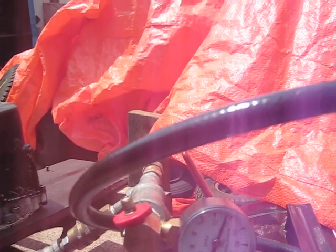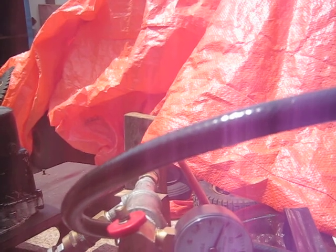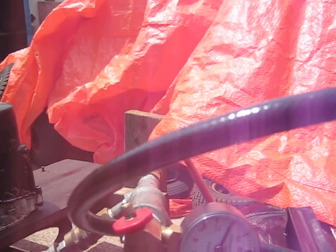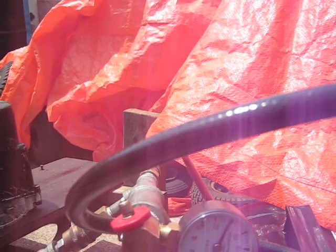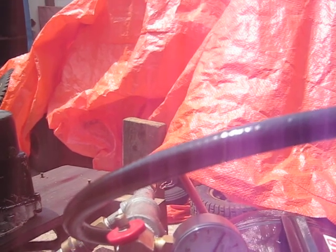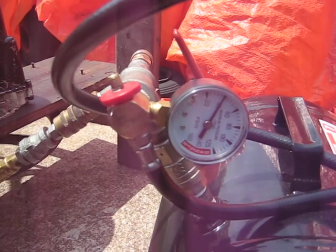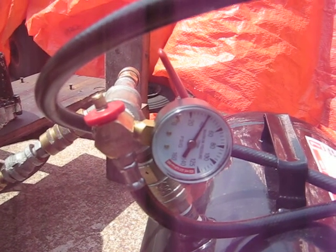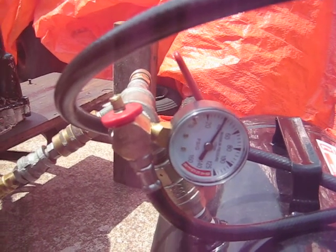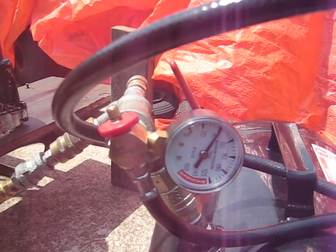What it appears is that to get any serious pressure you need to build your own steel head, because you need the minimum clearance volume — or in effect, combustion chamber volume. As I saw in the first video, it's going to get 30 psi out of the stock cylinder head — it's just too much volume there. We're up to 40 already, so it appears this thing might actually pump a tank up to 50 psi. It's taking a sweet time, but it looks like it would actually work.